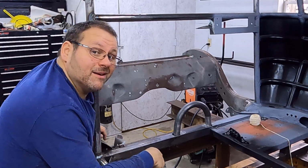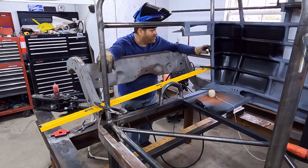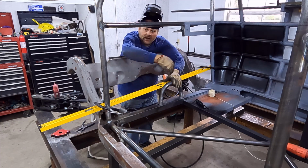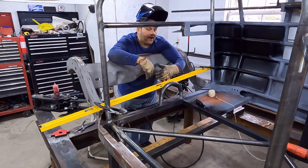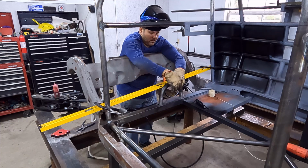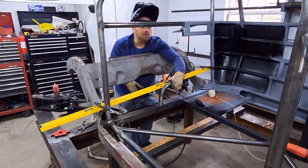But that one right there was on me. I've got a straight edge across here. I've clamped to my tubes on the back. The reason for that is we're using it just to align this tube. We want all of this to be one wall in alignment. We don't want it to be deformed in or out. That creates structural weakness. So pulls just a little bit, and it's sitting on the floor of this tube. Anyway, so I'm gonna hold it and get some spots on it.